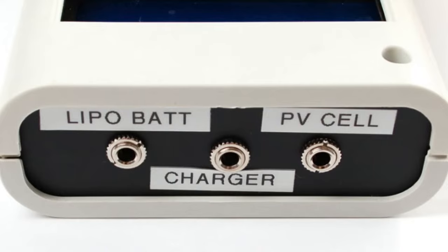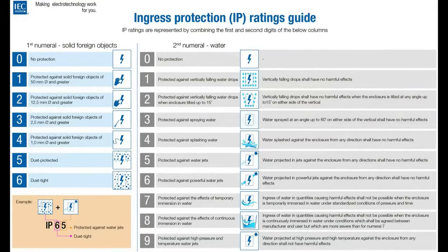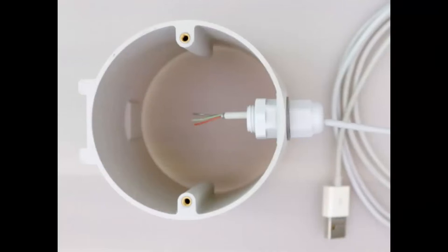The problem is that if you're just drilling holes and connecting random connectors, you're not going to get good ingress protection. And this is important if you're doing stuff that's going to go outside, in a dusty environment, in a workshop or in a factory, or just something that has to last a long time. We do projects that people do outdoors because folks want to do solar sensing IoT projects in the field, in which case we suggest, and we've used, cable glands.